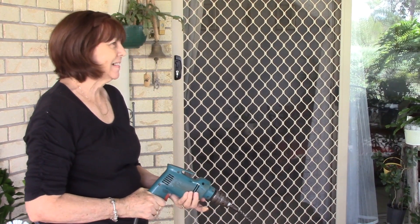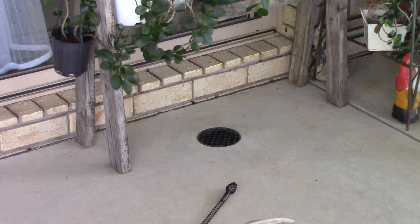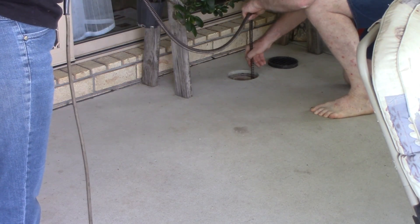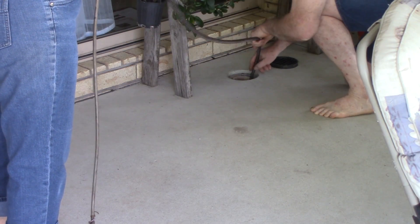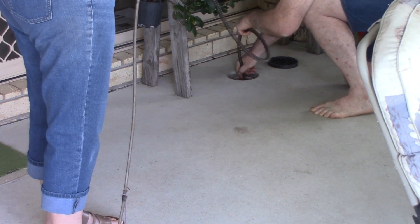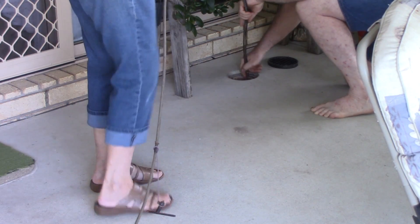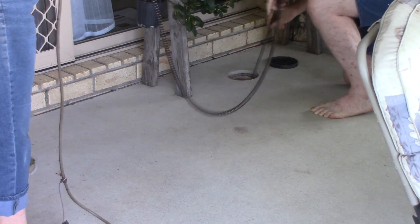There's my beautiful assistant holding the drill, ready to work it for me, because this is a two-man operation. That's the drain we're about to go down. Now, I found the best process for doing this was to just put one length of spring on the drill, feed that in, then unclick the drill, add another length, feed that in, and keep repeating the process until you've gone through the obstruction. Because this obstruction had given us trouble from time to time, I used it all — I went as far across the house as I could, which was about 20 metres. Now, I didn't use the gloves this time — just a little bit of oil on the drain snake. But it did occur to me that if you've used the drain snake a little bit, it might have little nicks on the spring and sharp edges, so the gloves would help protect you from those. They do have a purpose, and you probably should use them just in case.